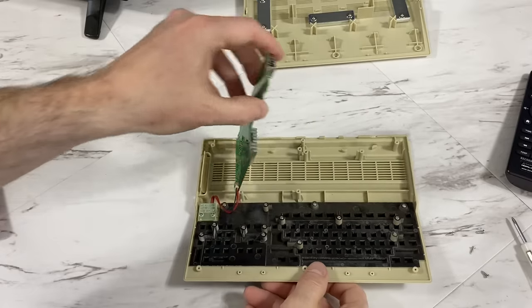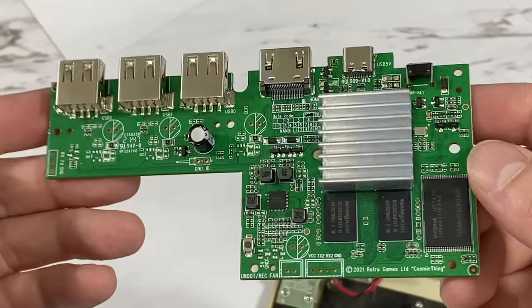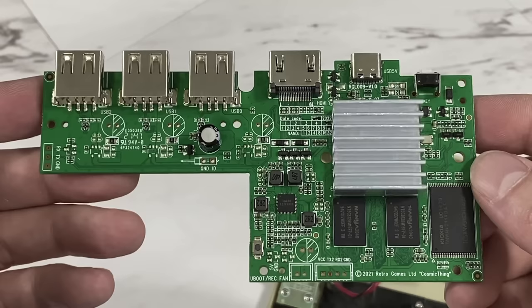Let's look at the PCB. There's not much here — I see what appears to be a couple of RAM chips and a flash ROM chip. I suspect there's some sort of system-on-a-chip behind that heatsink, but I'm not sure what kind. It looks like they left off 4 capacitors that the original design must have had. There's also a small button of some kind that I don't know the purpose of, and 2 missing pin headers — I wonder what those are for.